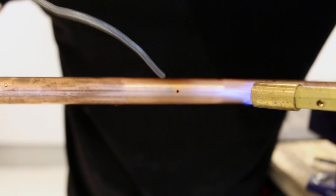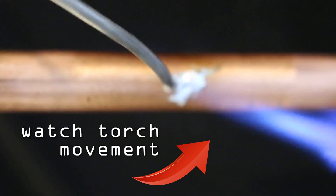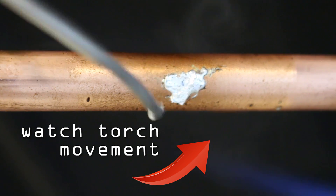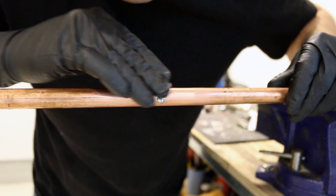Just enough so your solder will melt. The trick here is to use your torch to heat the pipe up at the right temperature. To do this, keep it close in the beginning and when the solder starts to melt, remove the heat from the pipe and alternate just like this to keep the right heat on your work area. When the gap is filled, wipe off any extra flux and inspect your work.